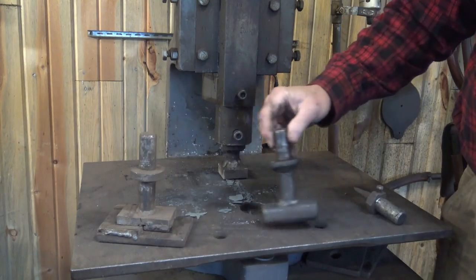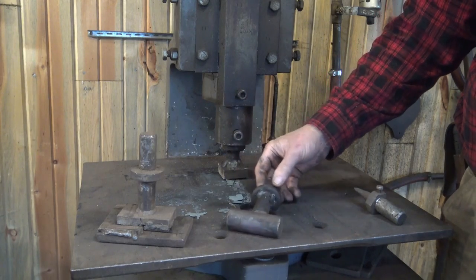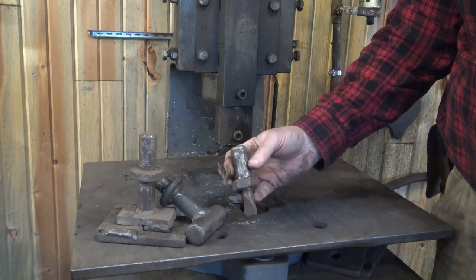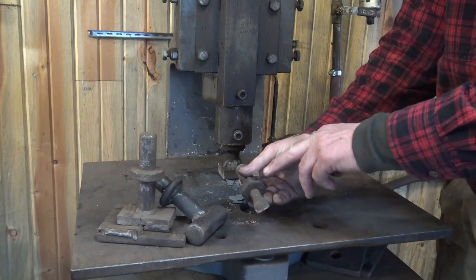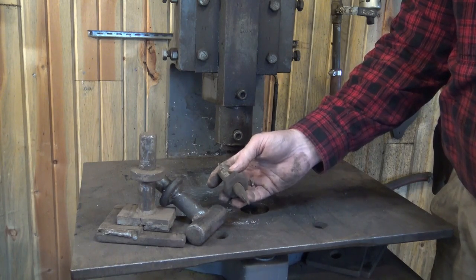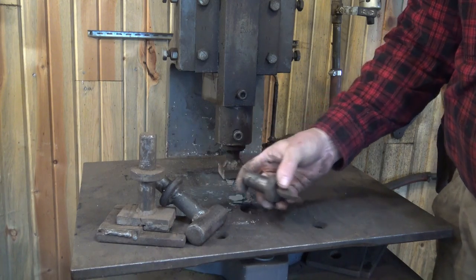And you can make just about any tooling you can imagine. The tools are almost always shop made, although there are some people that do sell tools out there. This is a chisel. This is a 1 inch bolt. The head of the bolt forms the stop collar. I bored it. I've got a set screw, and I can put little chisels in there. It's a 5/8 hole in there, and I can make all sorts of different tools out of smaller material for more delicate stuff.